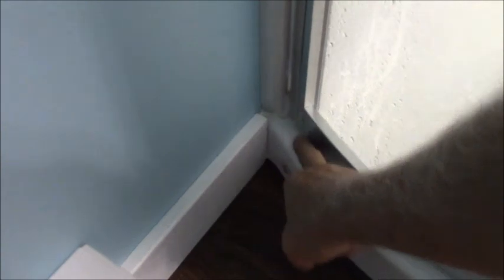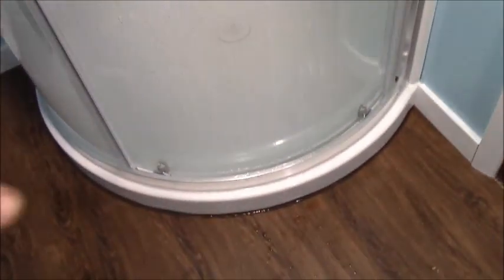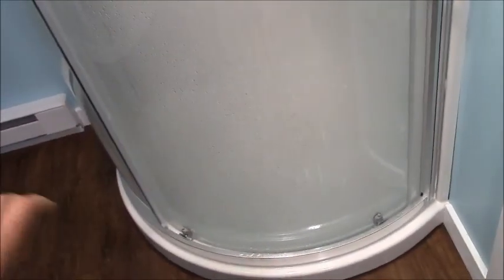Of course we got the single-mix shower. I just hooked up the water heater — let's see if she gets hot. Oh yeah, it's getting hot already. That water heater is just downstairs. We kind of came up the stairs and around, but the water heater is kind of below us here. I need to test this shower because I finally caulked it all, and I want to make sure I don't have any leaks. That was leaking over here in the corner bad, and I don't see any water coming out now. I had to leave a quarter-inch gap around the flooring and the base. The base is all molded plastic with styrofoam filled underneath — so it's solid. All the plumbing is downstairs.